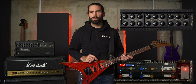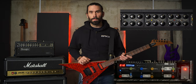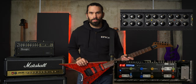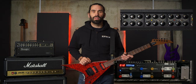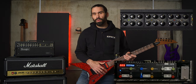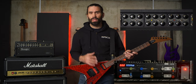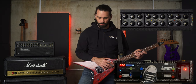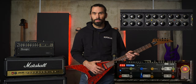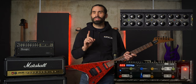There can be an issue using only one switch though. What if I don't want the patch to change when I change pickups, or the bank I'm using isn't set up normally with the lead-rhythm-clean configuration? Of course, I've accommodated for this. On the rare occasion I don't want the patch to change when I change my pickups, all I need to do is step on the pedal. Now the switching system is in manual standby mode. The guitar will still send signals to the box, but it won't do anything with them. You can tell it's in manual standby mode because the LED slowly flashes on and off. It will still receive changes from the ES8, so when I hit the switch to put it back in active mode, it will make sure to stay on the current bank. If the bank doesn't use the normal lead-rhythm-clean configuration, instead of sending a bank signal to the switching pedal, it sends a signal to go into auto standby mode. It works the same way as manual standby mode, and you can tell it's in this mode because the LED brightness ramps up and down. When I switch back to an active bank, auto standby mode turns off. Also, when the pedal is first turned on, it starts in auto standby mode until it receives a signal from the ES8.